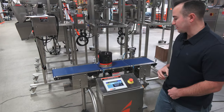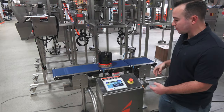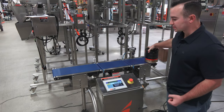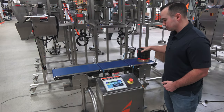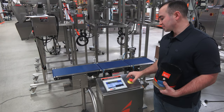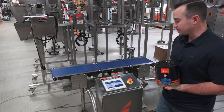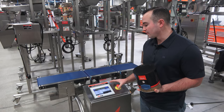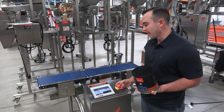I have four more samples to run, and as you can see it's running very accurately — we're getting variations of only about half a gram to a gram. After the last pass, we see our results. Our standard deviation was 0.21, which means our accuracy on this particular run at 73 feet per minute for a coffee can weighing about two and a half pounds was 0.21 grams. We quote everything at two sigma, so if you double that, you're still at plus or minus less than half a gram, which is very accurate.